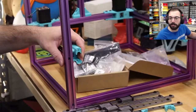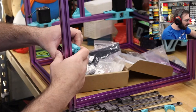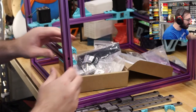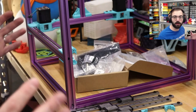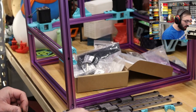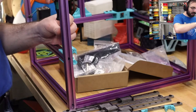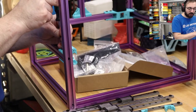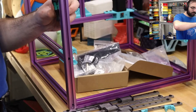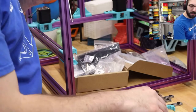So, interesting concept. You can print helmets very comfortably on a 350. A 300 is perfect for smaller helmets. But if you're just printing it for fun and you don't actually have to print it, I don't know. Especially in an enclosed CoreXY, think about this: the heat up times on a 350 are probably much worse than a 250, because the chamber size is bigger. You might be spending an extra 10 minutes preheating your chamber for the same print. So if you're looking for a faster printer, I might recommend a 250, both fast in heat up times and in print speeds.